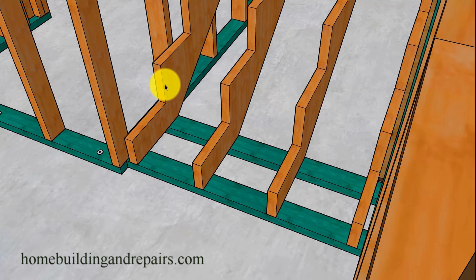I've seen thin skirt boards where the skirt board is about a quarter of an inch — if that's the case, you won't need very much space. Allow for the drywall — half-inch drywall — plus the skirt board if necessary, whatever those dimensions are going to be. Give yourself an extra quarter or eighth of an inch so that everything will actually fit.